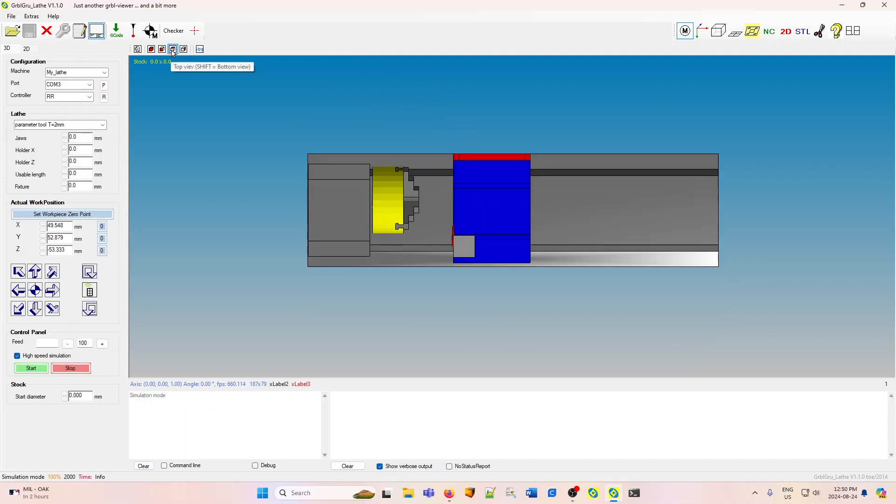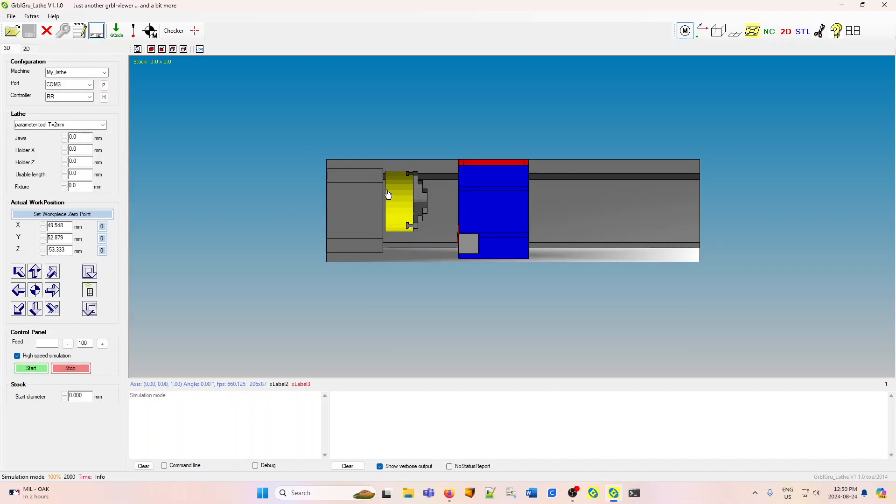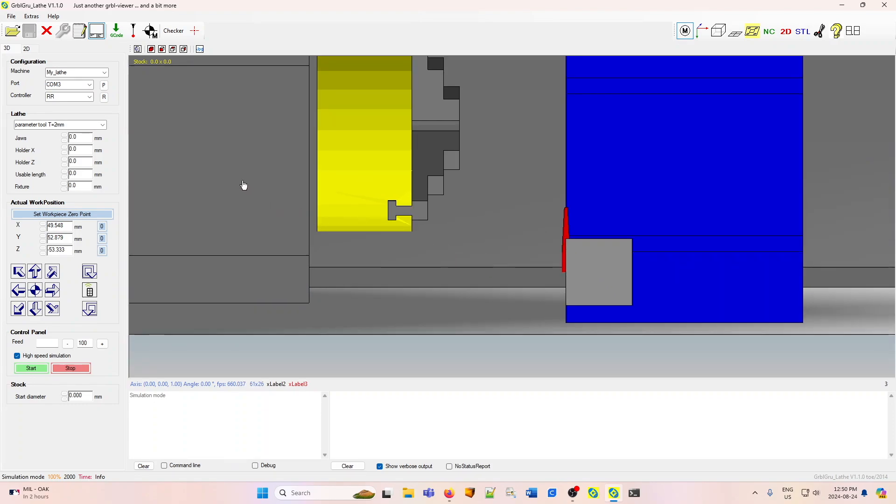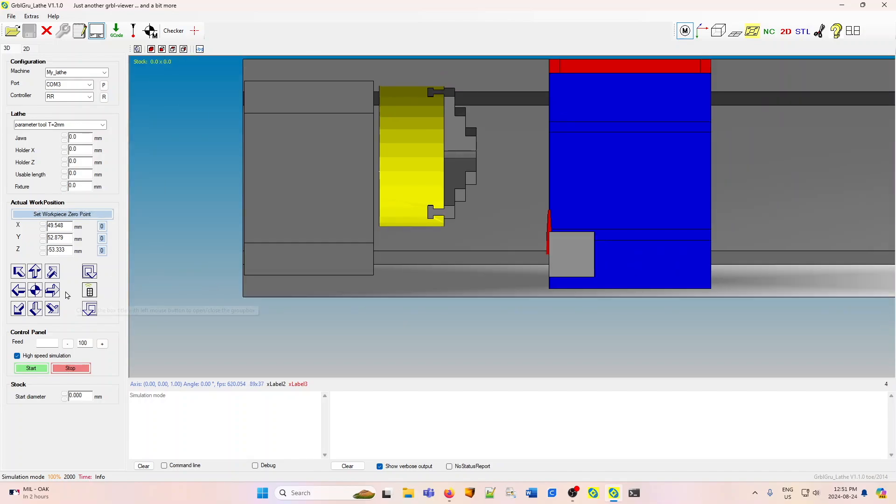I prefer looking from the top because that's how I see my own machine. If you hold the left mouse button down and draw a rectangle and let go, that will zoom in on that area. Lathe tools can be chosen in this little box — there's a limited number, and they show up on screen as what they are. I usually use a shape D or a parameter tool that I've defined, that's very long and slender. To move around is pretty standard using the buttons: to go left and right, to go in and out, and to get back to zero, you click on the center one.